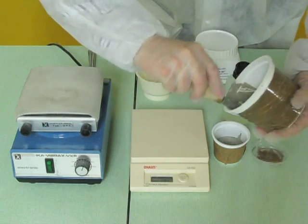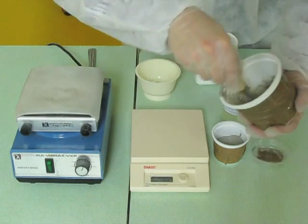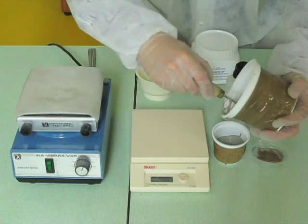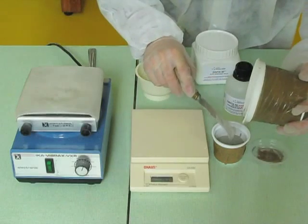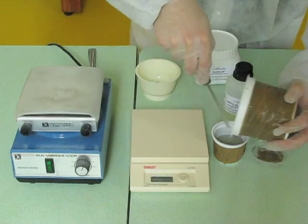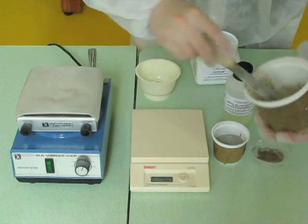The setting time depends on the room temperature. If necessary, to accelerate the setting, let it first set during 2 hours at ambient temperature. This allows the chemical reaction to react completely. Then, place the mold in an oven at 60 degrees C for 2 hours.